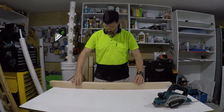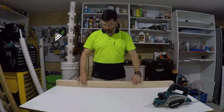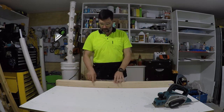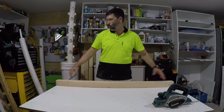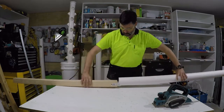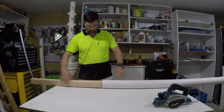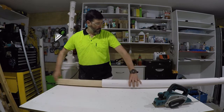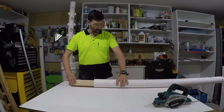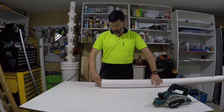Most planes have a little groove in the centre which is easy to line up on the corner of the bit of wood so you don't have to worry about getting lined up. Just pop it in that groove and make sure you're on quite a small cut. You're better off doing a couple of small passes and testing in between than doing one big cut and making it too loose. That little step you can see doesn't matter because when it's in the pipe it'll average itself out. The crucial size is the 62 by 62, and now you can see it's sliding in a lot easier. You only need one of these because we're going to use the same one on both poles.